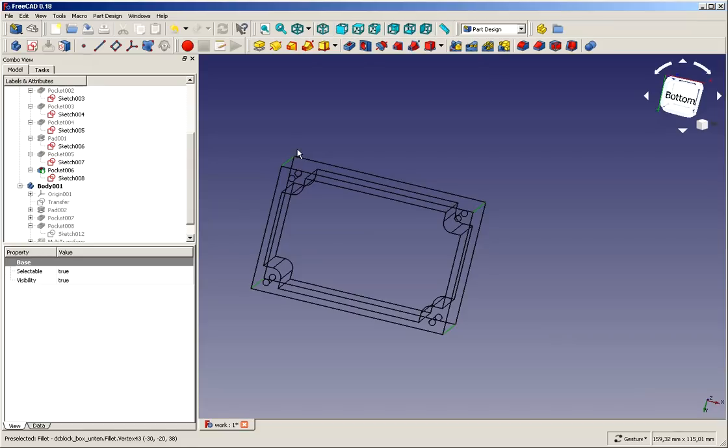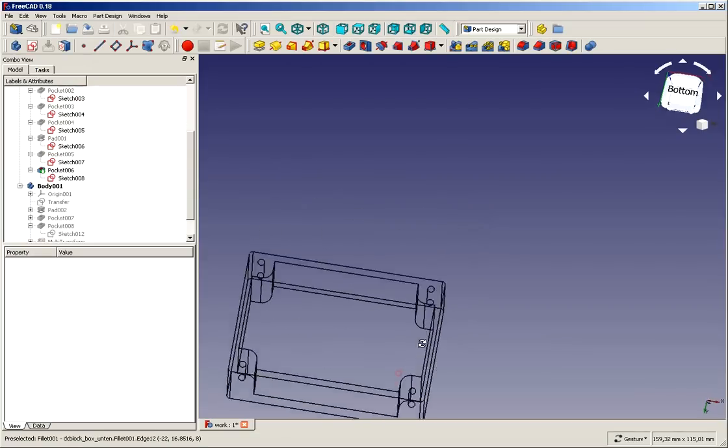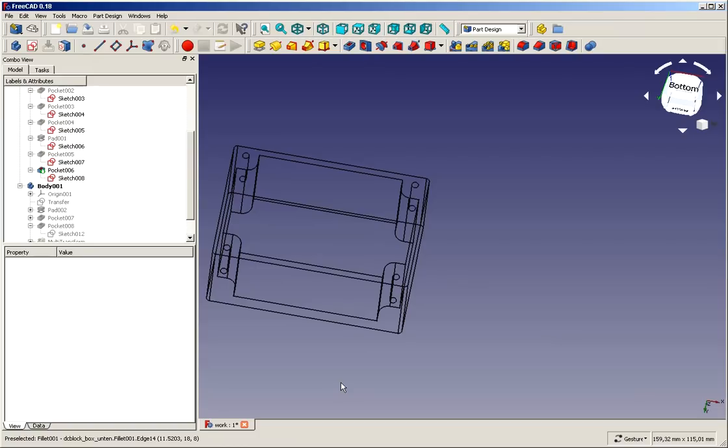And for the outside, where it's even more important, because steep corners, rectangular corners, sharp corners, so to speak, they are easy to create some ripple when your printer stops fully and changes direction. If the printer can move around, then it's easier. It's similar with CNC machines. There are some structures which are better and some are worse. And here I found out if I do a little bit of chamfer around it, it will make it easier for my printer to create a nice surface.